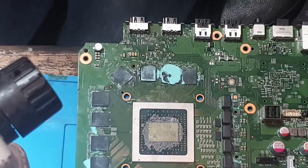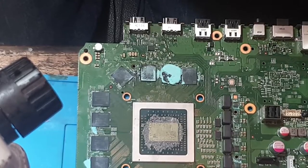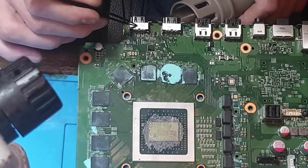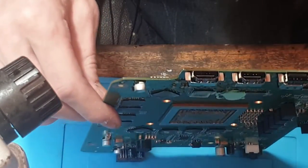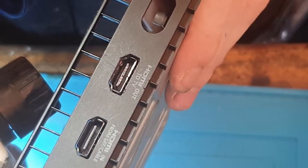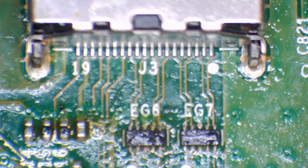That's in place. I'll flip the board and check the alignment by popping it into the chassis — we're in position. Now I'll solder these ground legs from the back, adding a bit of flux. Let's clean up the back. The alignment isn't quite as lined up as I'd like after all that fiddling, so I'm going to heat from the bottom and let the port drop into place properly — airflow up to 80 percent. I saw it drop into place. The plastic locating piece has gone through. Checking alignment once more — absolutely perfectly lined up.